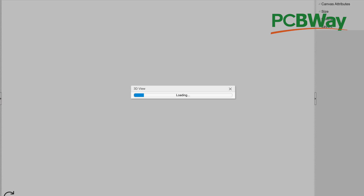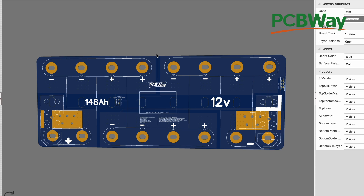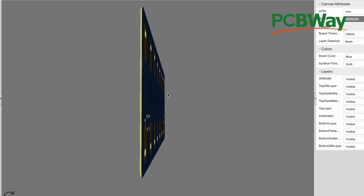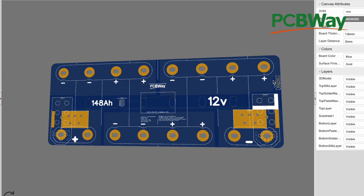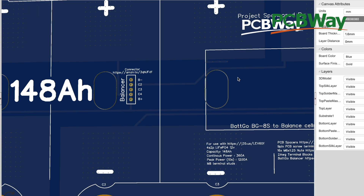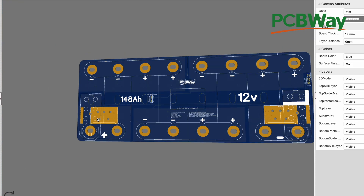So let's look at the 3D version of this. The reason why I'm not showing you from the ground up is because we've drawn these before — those little four-cell bus bar PCB projects that we've shared before. All I did was just copied and pasted two of those and then merged them, and just made sure that the distance between these and these were the same. And then we ran the copper traces and stuff. But this is what it looks like. And I'm going to point out certain things — like this is the balancer connector, right? And it's right here so that you have a little cable and then you put it right here on the center.